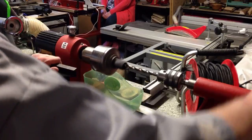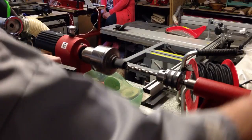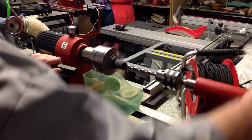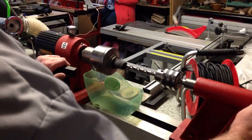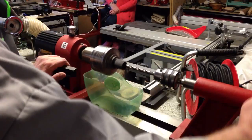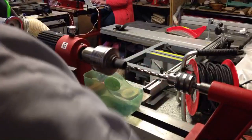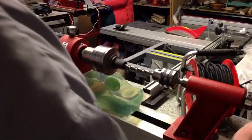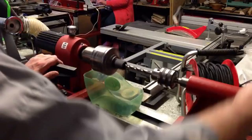I've heard some people when they're doing pens start really cranking it through. This is a tough old piece of oak that's been buried in the ground for thousands of years, so I certainly wouldn't want to force it. Quite a nice smell. To me, it's letting off almost a toffee caramel sort of smell. Nice and slow. And then periodically, I'm going to pull it back, wind the bobbin in, then we can push back in. So I hope you're following so far.